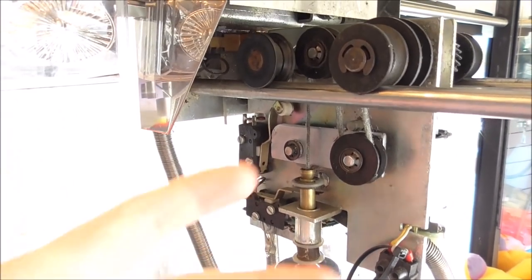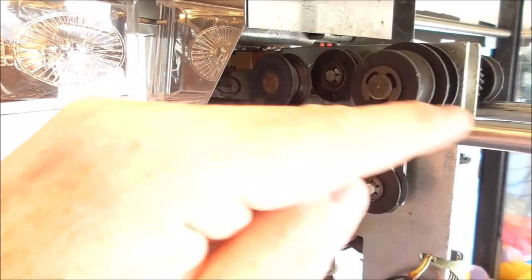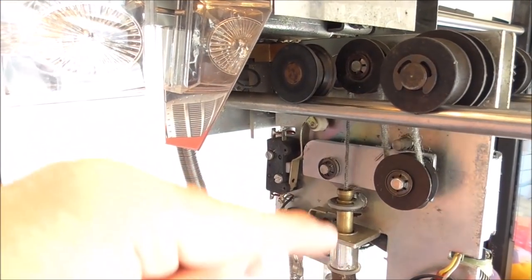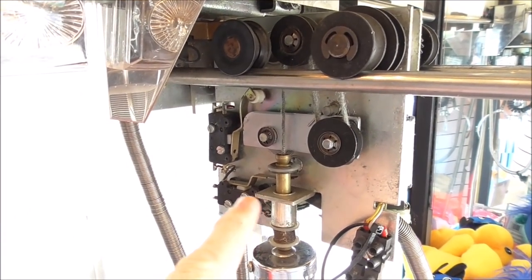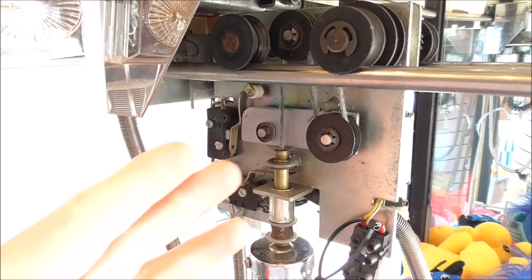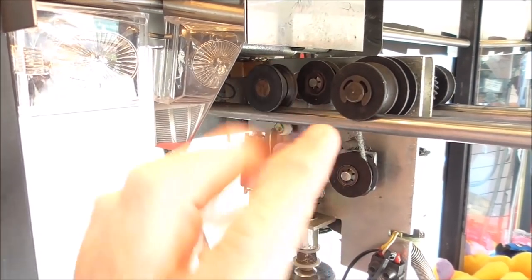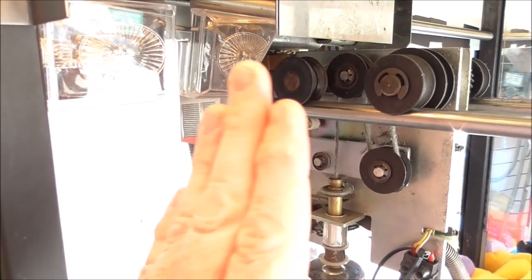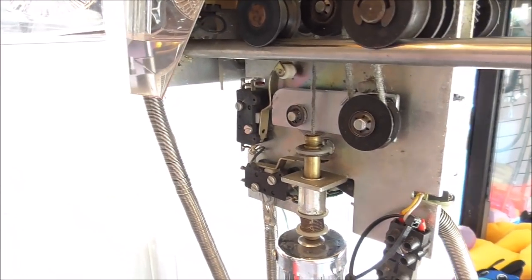There should be something that makes the claw close, which it isn't doing right now, but we'll figure that out. And then the one that drops the line will start going backwards, pulling the line back up. And then once it gets all the way up and it opens this switch, like we looked at on the schematics, it will then make it go this way until it closes that switch, which will then make it go this way until it closes that switch. We still have it rigged up with a box, but we'll fix that later. So we're about there